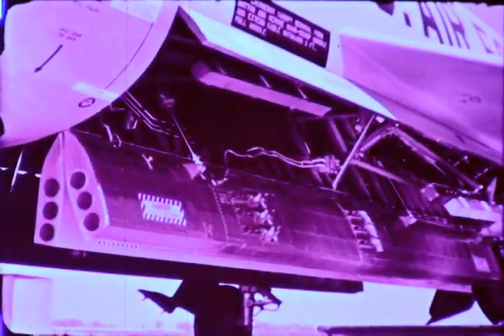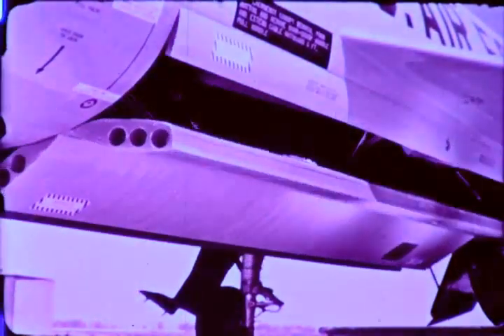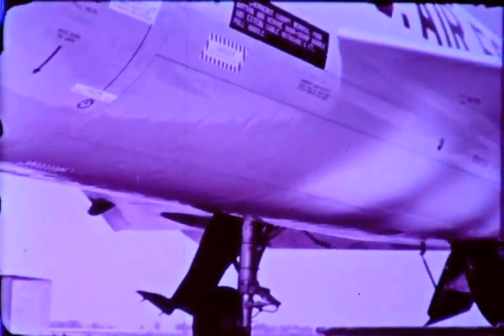Let's watch the action in slow motion. Electrically controlled air pressure at a regulated 1,500 pounds per square inch activates this equipment. The cycle of opening or closing on the ground is about one second. To actuate the doors and launchers, snubbing pressure must be present in the system or extensive damage to the airplane will occur.